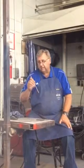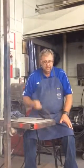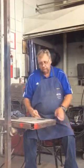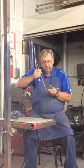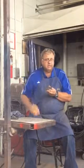The other technique is simply tapping down. Tap and then raise it right back up. So I'll tap down and raise up to 1/8 of an inch, and then I'll start welding. As I get to the end of the weld, my travel speed will have to increase a little bit quicker because it'll burn off the metal right here. That's just another little tip.